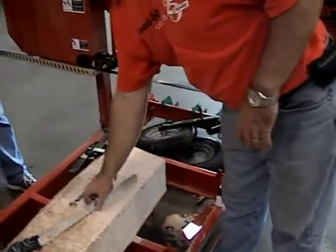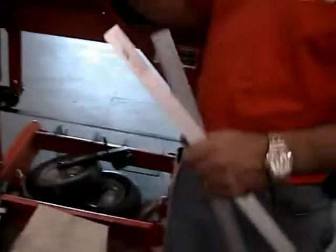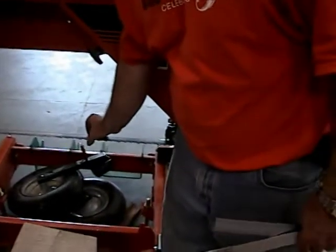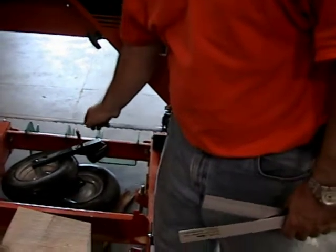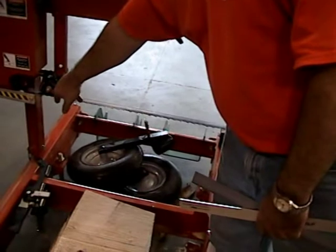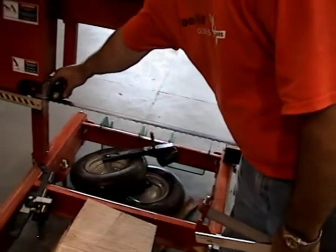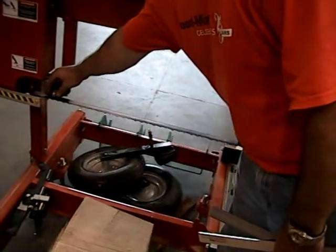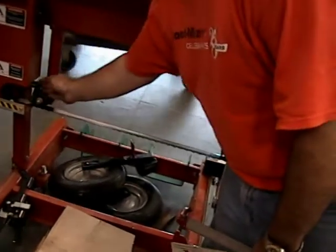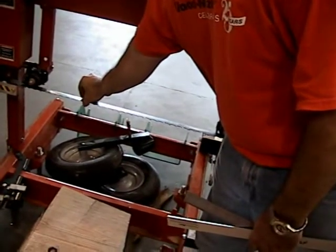Okay. The last thing you're going to check now, another thing that can cause a customer to have wavy cuts, would be if that blade's pointing up or down. And they will point up if the bearings inside here don't fail first, before this roller starts to taper. But these things will start to taper, they'll get smaller as the blade rides out here towards the front, which would then cause this to do this.